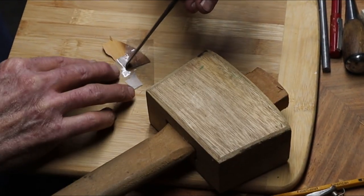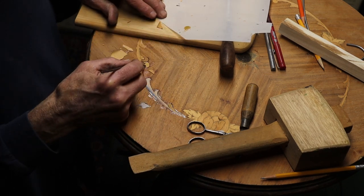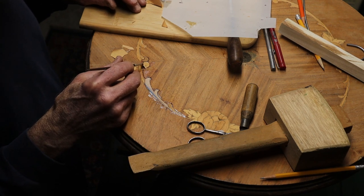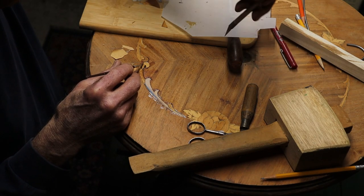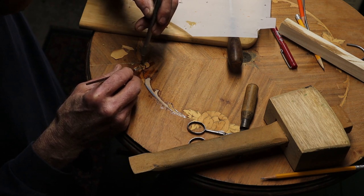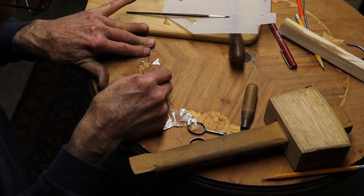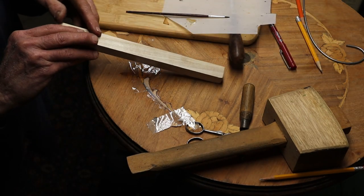Here I'm just making the piece with a sharp chisel. I'm putting in some hide glue here so I'll have a chance to work with this one a little bit longer, and that little piece slides right in there and then it's going to get clamped. Again, tape either way on this application — I like to put the sticky side down. That way I know the piece isn't going to jump out of place when I go ahead and clamp it up.